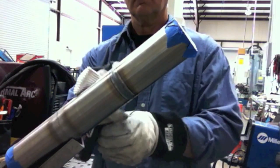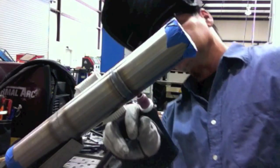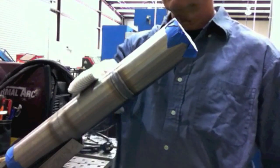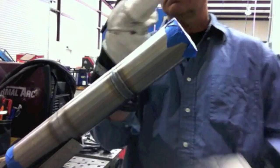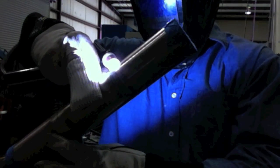On a 6g you've got one side you pretty much have to do left-handed or figure out a way to position your right hand. I'm flopping the TIG finger around where I have more layers to hold it, and that seems like it's going to be pretty easy to slide along and make the whole run after taking a few dry runs. It's always good to take a few runs at something before you light up — things look different under the helmet. In the magnified view it looks like rebar on a 5-gallon bucket, but this is more like what you would see underneath the helmet. Just very tiny circles, trying to move on — it looks slow, and it is, but this is how things go when you're a little out of position. You want to try not to hang around too long on stainless steel or it'll turn out all gray.